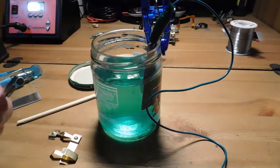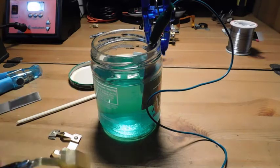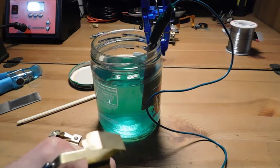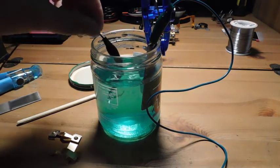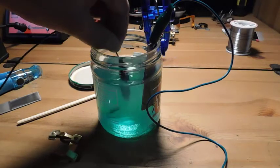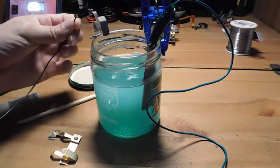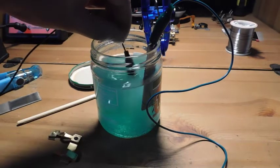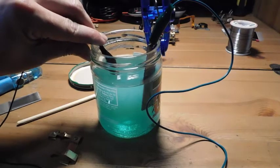What we're going to do now is take the anode and connect it to one of these battery terminals. It's important that you don't touch the battery terminals because you don't want any grease from your skin getting onto them — it'll interfere with the electroplating process. Now we're going to put the anode back into the solution and just move it around for a couple of minutes. You can see that it's doing something — the water's getting cloudy and it's starting to change color; it's a little bit more silver now. I need to do this for a couple of minutes, so I'll leave it in the solution and be back in a minute to see how it looks when I'm done.